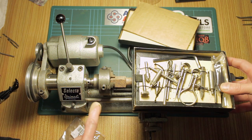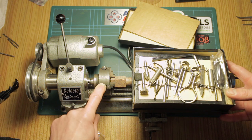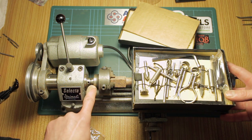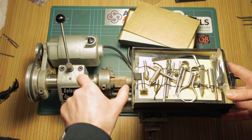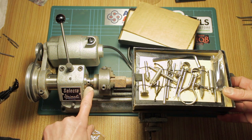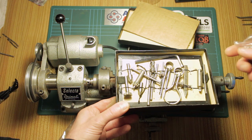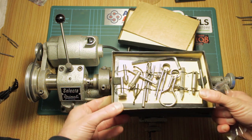There's another cutting tool and the key for the four-jaw chuck. This four-jaw chuck is an M14 thread chuck with an M12 adapter from a Unimat 3 — the Unimat 3 uses an M14 thread. A four-jaw chuck gives great accuracy and centering, but because of the adapter plate you lose a fair chunk of space between centers — about three-quarters of an inch — which is a shame. For the small stuff I'm planning on turning it shouldn't be too much of a problem, but I would like an original M12 three-jaw self-centering chuck.